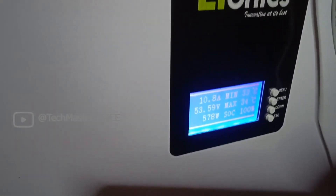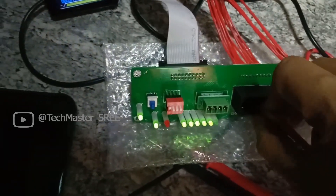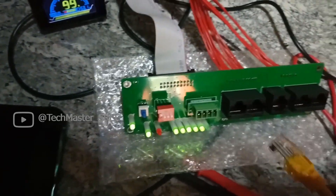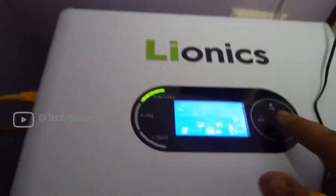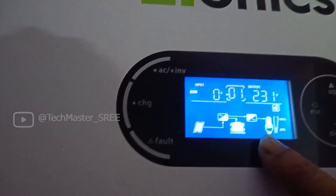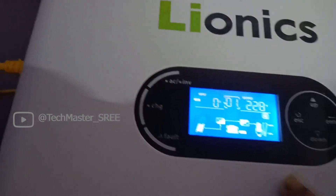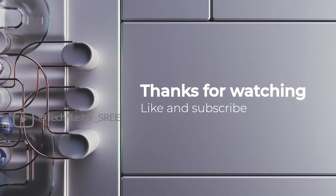This inverter will help you identify whether the communication is successful by looking at the Li icon near the battery. Right now this battery is 100% charged. We have removed the CAN cable from this battery and connected it to the JK BMS, so now it's charging at around 10 ampere because the BMS is reporting 99% to the inverter. When we disconnect this cable from the JK BMS and connect directly to the Leonix Power Wall, it will stop charging. Nowadays we don't need to do bottom balance — we can simply handle top balance using the inbuilt smart balancer of JK BMS. You can see that when I remove the communication cable from the JK BMS the Li icon disappears; when I connect it back, the inverter detects a lithium battery and the Li icon reappears, confirming successful communication.